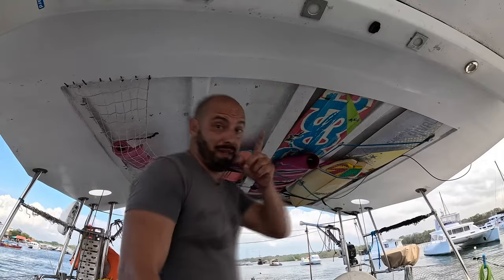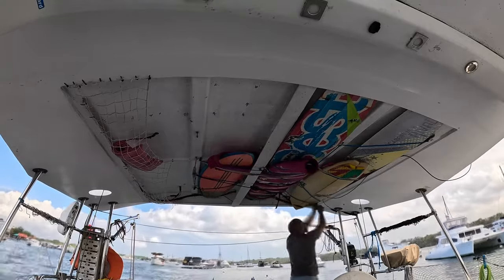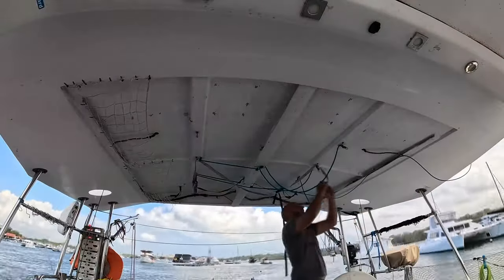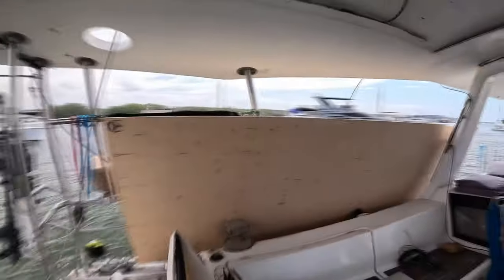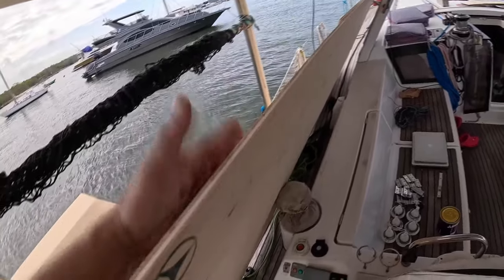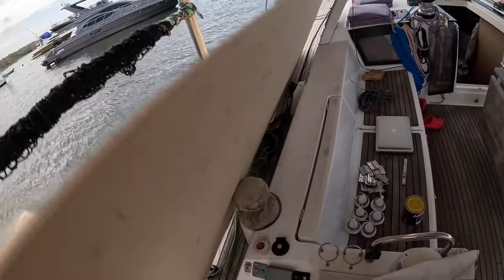Alright, let's start analyzing. Everything has been cleared from the ceiling — it's ready for installing the panel. Look, the guys are heading out. They brought us some plywood. It's 9 millimeters thick, and to prevent it from water damage since it'll be used indoors, we're going to paint it. These two sheets here, they need to be cut and marked now — that's what I'm about to do.